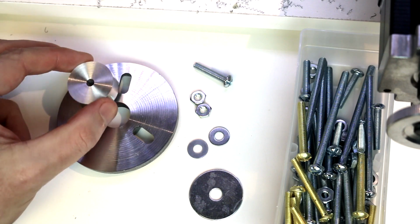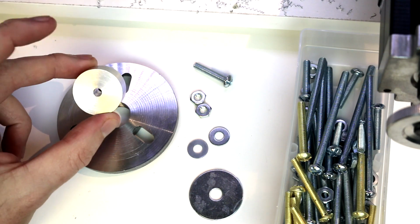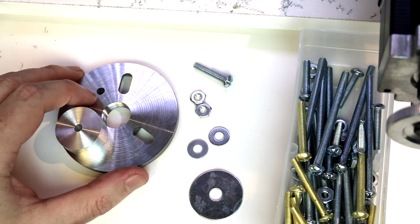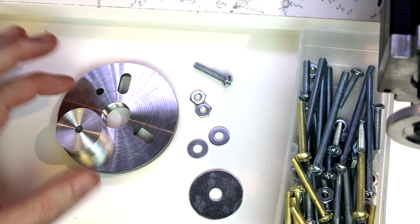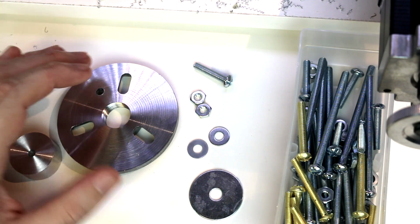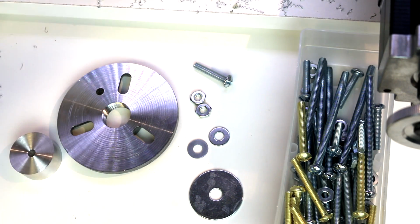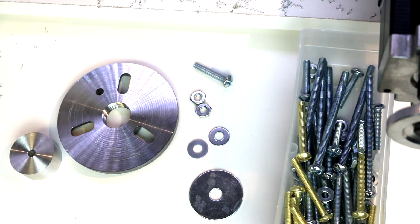We're going to do a fairly simple setup, which is a workpiece with a hole through it. This makes it quite easy to secure. And I've also drilled a hole into the faceplate at a particular location. And this is what I meant by this is sacrificial, is over time you'll drill holes and slots and different methods, notches in the end to help hold pieces on here, and eventually it will become so riddled with holes that you can't put another one on. So you may end up making another faceplate or another specific type of little jig.